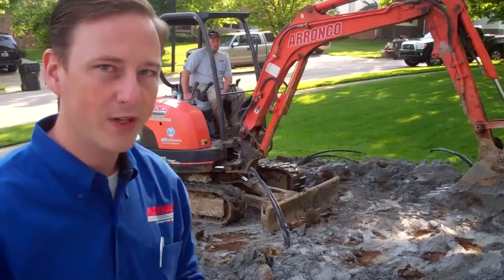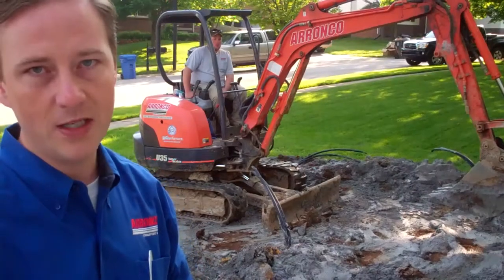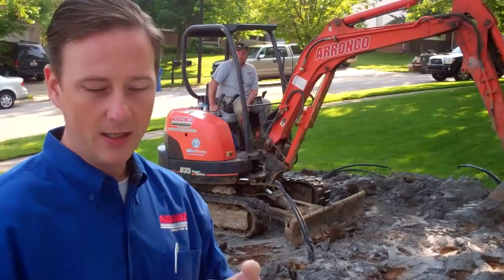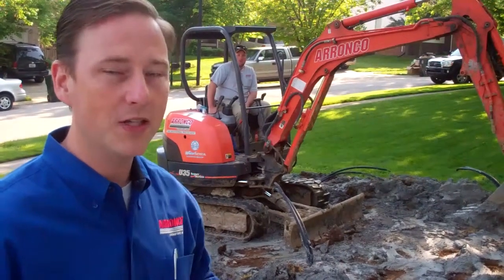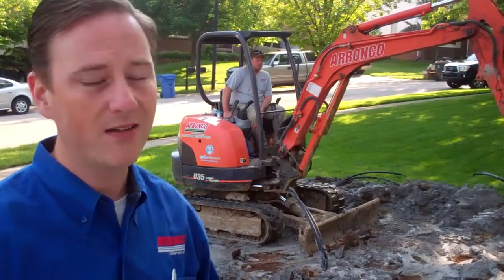And we actually do a little bit of a different method. The older method would be to glue those, just like PVC in your home. We actually have a fusion machine. You take the 2 pipes and put them together, it heats it to 500 degrees and seals it just like a factory would. So with our process, it's never going to leak.